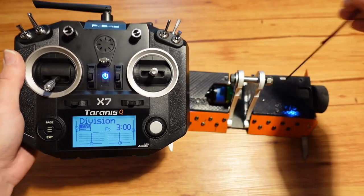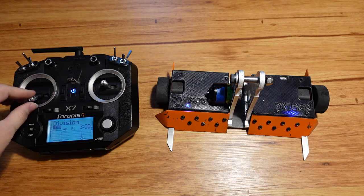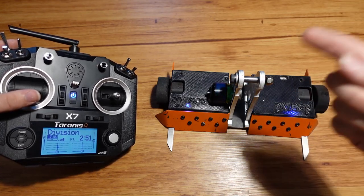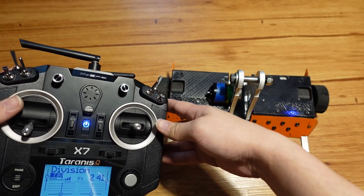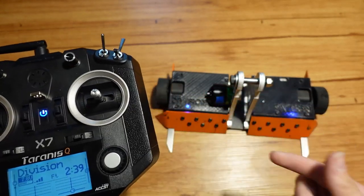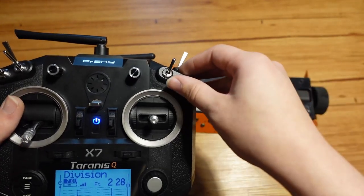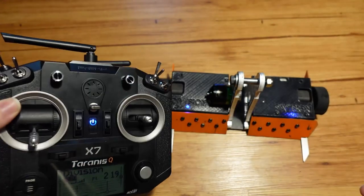So now when I turn the robot on, I have some blue tape on the motor so you can see if it's spinning without the weapon on, because I don't want to kill myself. Right now, throttle does nothing because the robot is disarmed. I arm it with this switch and now it's spinning this way. If I flip this switch, now it's spinning the other way. With that switch off, it's disarmed no matter what I do with the throttle. I also have it set up so that it brakes really fast when disarmed — basically I need to be trimmed up a bit or else it'll brake. In normal operation going down to zero it doesn't brake, but when I have this switch flipped it will brake as an extra safety measure, so the weapon will stop right away if the radio loses connection, I drop it, battery dies, et cetera.